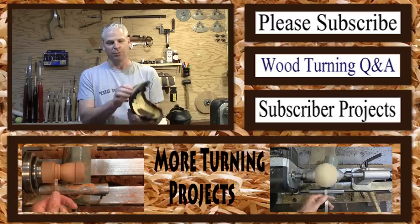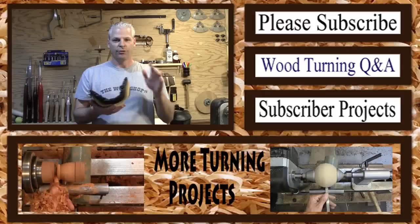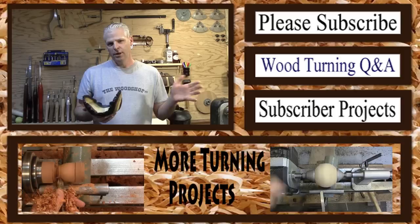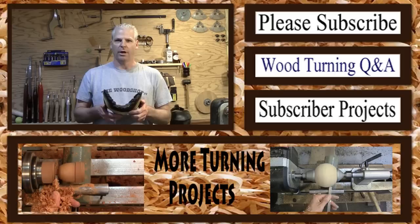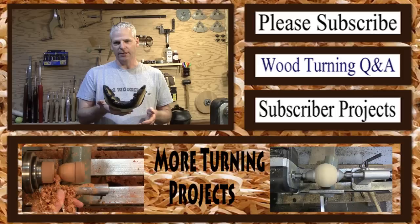So what I did was I took it right off the lathe after I turned it and put it in the microwave 30 seconds at a time. I put it in for 30 seconds, let it sit for 15, 20 minutes to cool down, and put it back in. I kept repeating that process for several hours, maybe about 4 hours or so, until the weight stayed the same. That's all I did was weigh it to determine when it was dry.